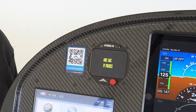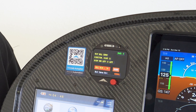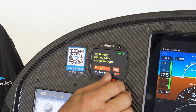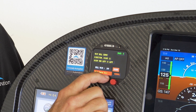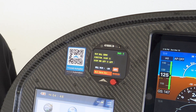We go down to cage attitude and turn it until it says cage on the window. We click on it and after five seconds it will automatically cage. Remember, the more synchronized you have the caging of the artificial horizon, the better the autopilot will work. On page two of our phase one calibration, we will find the servo direction — first, the roll servo direction. In order to tell the autopilot which direction the servo should go, we click on the knob and trim. By moving the knob, we can move the trim tab, like if we were trimming the airplane to the right or to the left. So make sure right is right and left is left. If not, just click on the knob again and you see the last question here on the screen, we can change it to reversed.